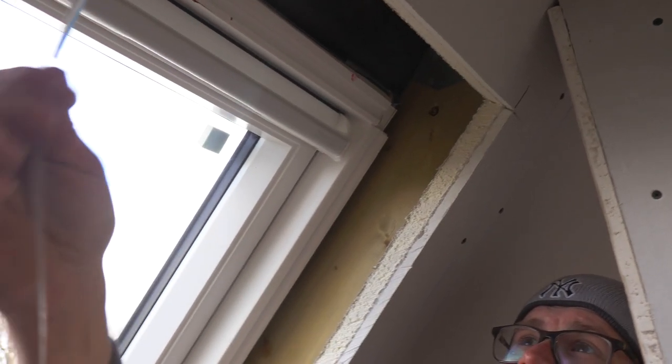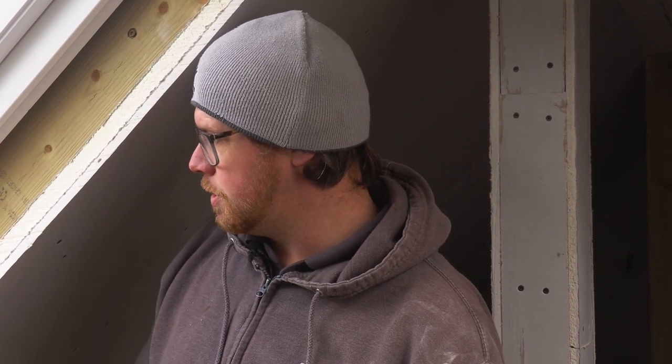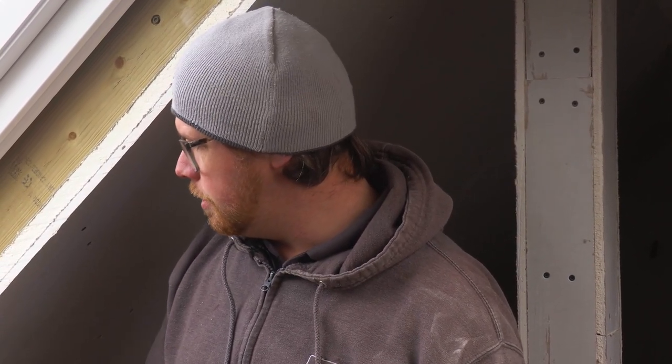The first thing we're going to sort out is our sides. The hole for the plasterboard has just been rough cut — we fitted the windows and when we came to plasterboard we didn't want to try and get it accurate on a great big eight-by-four sheet. We got it in roughly and now we can work out more accurately how to get these measurements. We've done our best to get everything parallel and square, but you get bows in timbers, and a nice square factory-made window may not match exactly with the raft — it could be two or three millimetres out. On four windows right next to each other, it's got to be spot on. So we're going to choose a reference point on the window — I'll use that edge there.